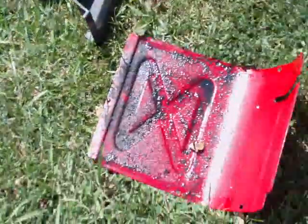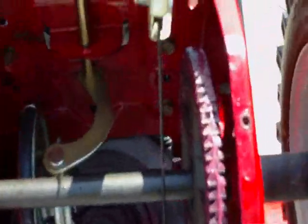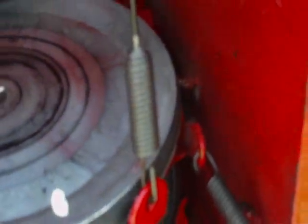You take this cover off right there that goes underneath your snow blower and your gears are here — see how it's all pink? Down in there where it's spinning, I put grease. Normally I've been putting oil on it, but this time I bought some grease and grease will last longer. I greased it up right there and now it's just coated in grease when it spins.